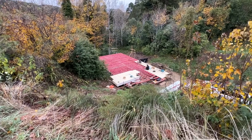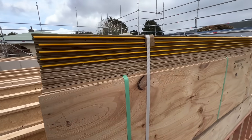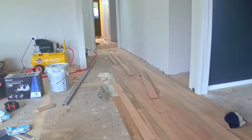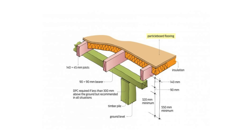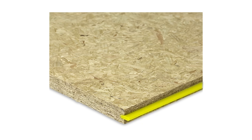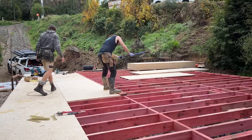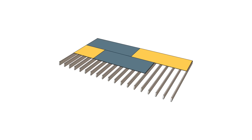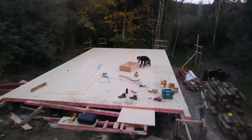If you're installing a subfloor for a structure, you'll most likely be using a flooring sheet such as strand board, particle board, or plywood. The top of the particle board will usually be what's called finished floor level. These boards have grooves where a plastic tongue locks both sheets together to reduce movement. When laying flooring sheets on a timber subfloor, use glue as well as screwing — the glue locks it up and stops squeaking. Always stagger your joints, and remember that in wet areas you need to use H3 flooring sheets.